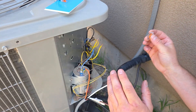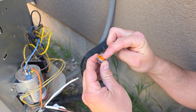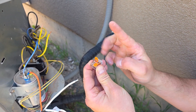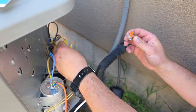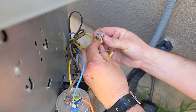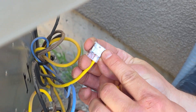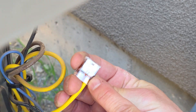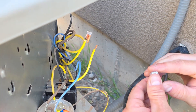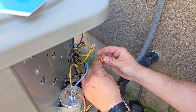The beautiful part about our install kit is it comes with these Wago connectors. How they work is they have orange tabs, and you lift that orange tab all the way up so it's pointing straight up. Then you take your wire and slide it right in there and clamp it down. You want to look for wire on both sides of the middle bus bar — that's making a good connection. Go ahead and do the same thing to the other yellow wire to get a good connection.